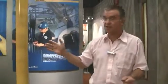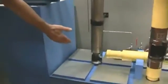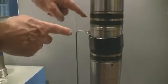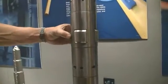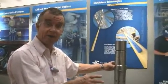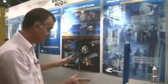Behind you will observe yet another valve. This valve at the bottom is very similar with a flapper, but if we move up you'll see there are some seals, and there's a hydraulic line going into this tool. Above it is a lock mandrel, which will fit into a nipple down inside the well. So this subsurface safety valve can be run in the hole on wireline. It has the same purpose — to control flow — but it is run on wireline.